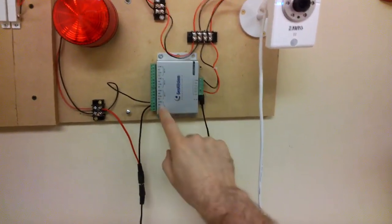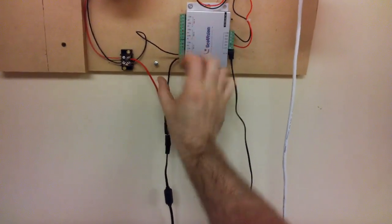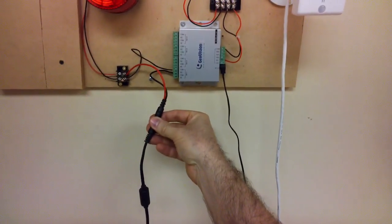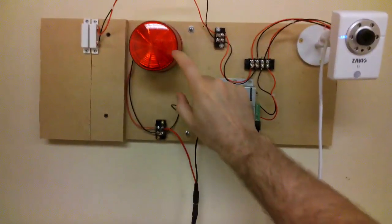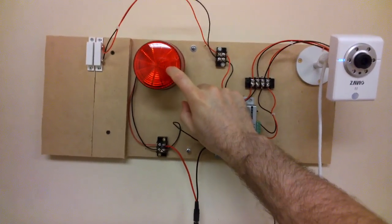What the GV Relay is doing is getting a digital output pulse from the camera and then triggering this relay, which is set to normally open. When that's tripped, it'll close it, which will close this circuit — basically this 24-volt low voltage power supply.